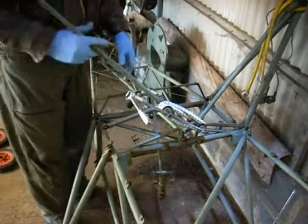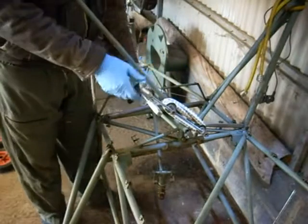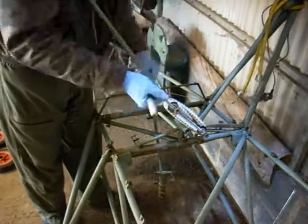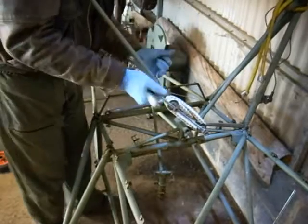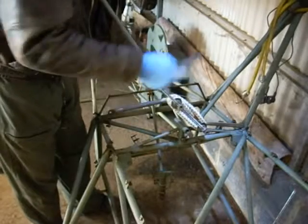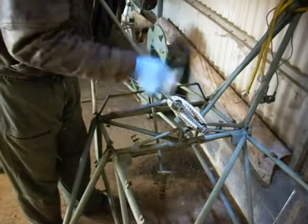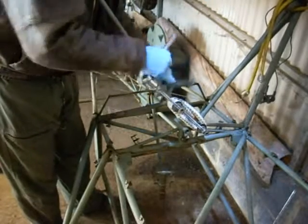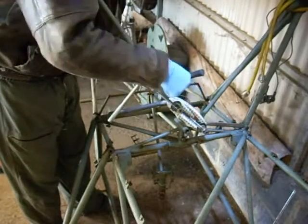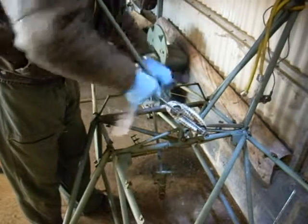Now what we do in order to change the rubber, because I'm going to put the genuine Neiman ring on here now, is basically to unload the tool. So turn these guys around and take the load off the tool, keeping the tool square. You'll soon notice that the tool is going bowed because the threaded rod here will start to bow, and that will start to damage the threaded rod.